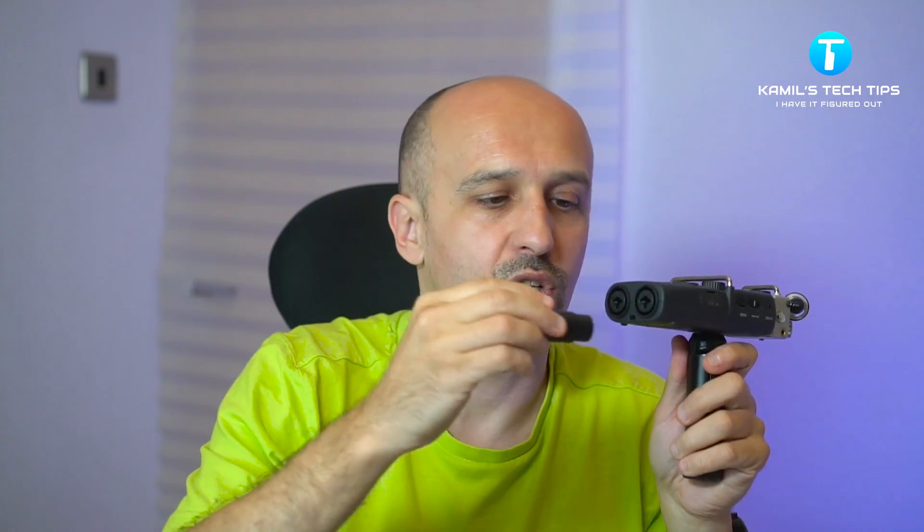Now, from a technical standpoint — this XLR-to-mini-jack adapter lets you plug into any interface, but you need one that can convert phantom power to plug-in power. Phantom power is the standard for providing power to microphones, usually 48 volts, whereas plug-in power is 5 volts. These mini jack microphones don't have batteries, so they require plug-in power. Most devices provide it via the mini jack port, but some don't. On the Zoom H5, you can actually enable or disable plug-in power for the mini jack port.